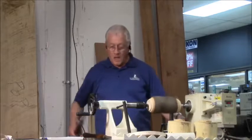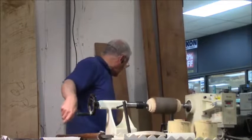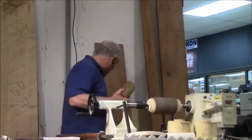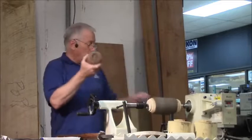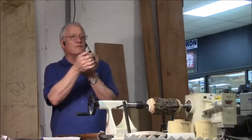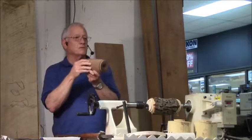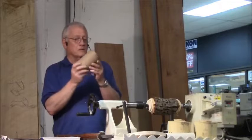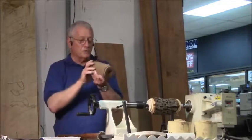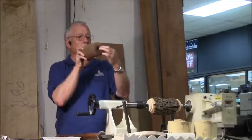But anyway, at this point in time, you're ready to drill two holes. So you drill the hole, as you see here, we can pass this piece, and this one I'm going to use, but we can pass this around. You drill the 1.5-inch Forstner, and you're done on this end. On this one, you drill a 1/2-inch, or a 5/8, whatever you happen to have handy. Trent Bosch came in a few years ago and taught us how to use a gun drill. That's what I use in this, but just a regular old spade bit from Home Depot will be just fine. And then go ahead and chamfer it, because this may be the last chance you ever get to do this. So I'm going to pass this around so you can see.